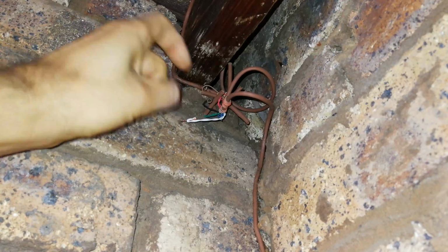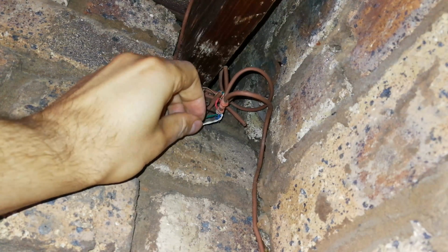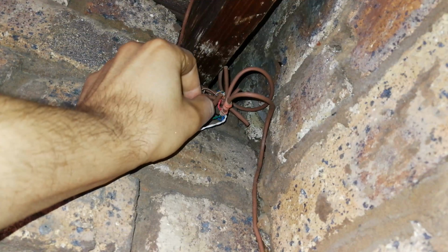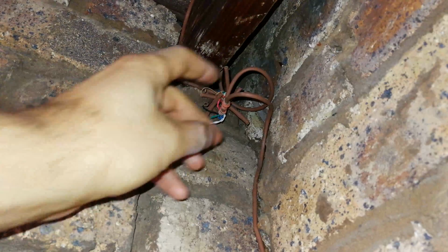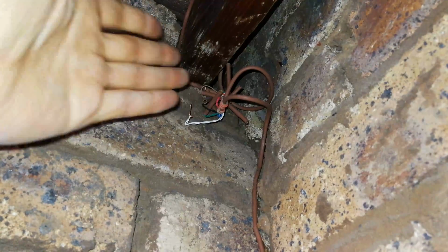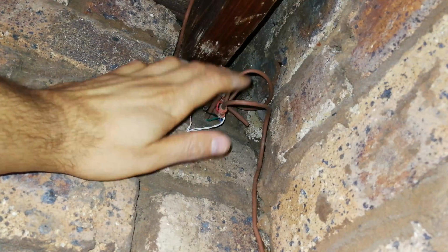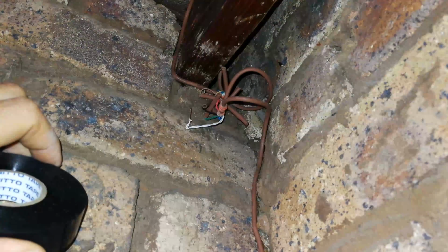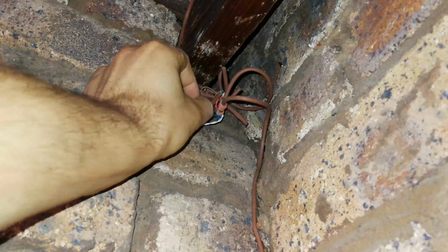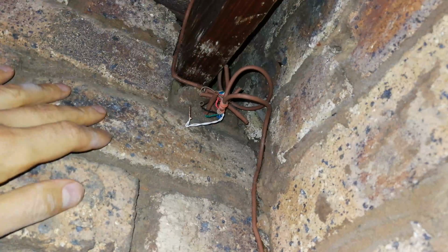On the topic of wiring, you can see that instead of using solder, what installers often do is they just twist the wiring, and okay, it's fine, but often these little covers fall off, and this wire could touch that wire, and we could have a short circuit, or maybe if somebody pulls this, it could be an open circuit. So this is not a good method. This eventually will lead to false alarms from birds, and as I said, people coming to do additional installations. My advice, put this in a junction box, or tape it up. Use some high quality tape. You can use Nitto. You can still hide it there, but most important, do not leave wires like this. These things just pop off, the wind, even bugs eventually, ants get in there, and it's a problem.